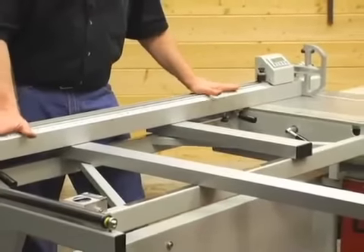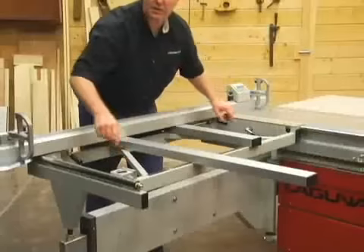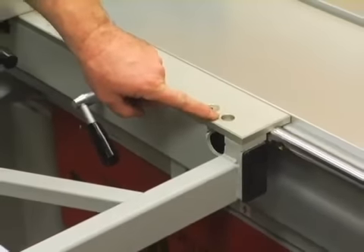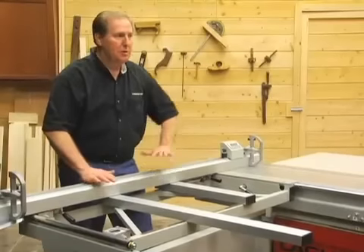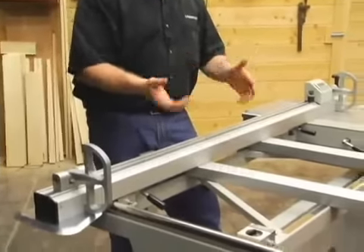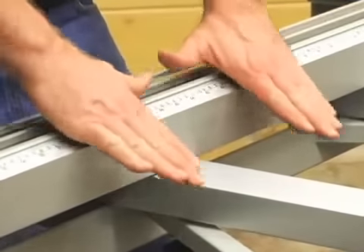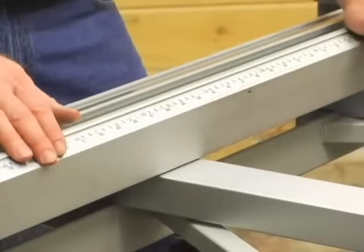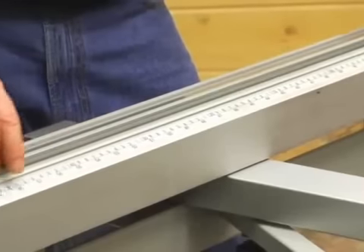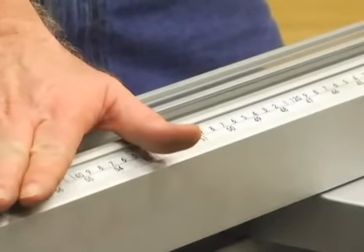This fence has two positions: a rear position toward the back of the machine and a forward position. You'll see that there's a pivot pin here — this is the adjuster block, and there's an adjuster on both the forward and rear positions. The reason for a forward and rear position is that if you're cutting small panels like shelves, you want the fence toward the front of the saw so you don't have to walk all the way back. One of the most subtle but important features is the placement of the tape on this fence. Instead of being set flat like a lot of them are, it's actually tilted toward the operator side of the saw, which makes it a lot easier to read. It's graduated in both millimeters and inches, down to the sixteenth of an inch, with both scales tipped toward the operator.